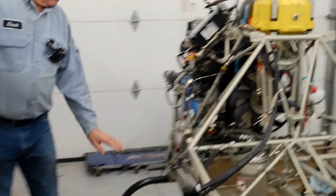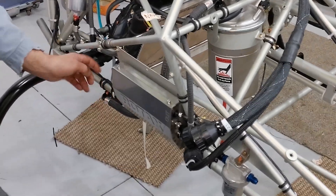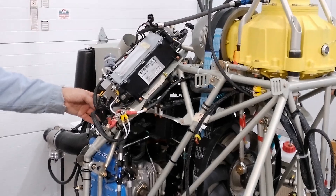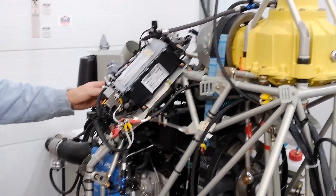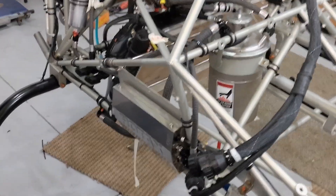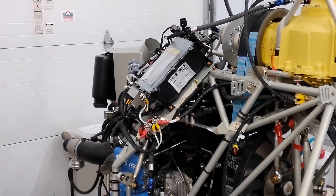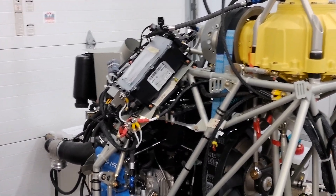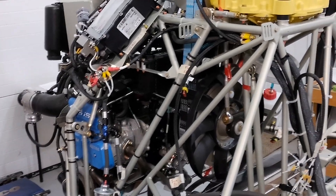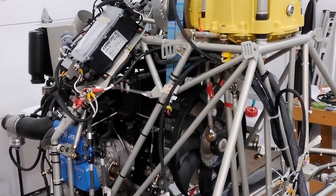I finished up the fuel pump — it's been here, but there were some wiring harnesses I had to make because the harness had just stopped here, and I had to tack in some wires down there and plug them into the pump. That's all done. I labeled the wires, and I know I mentioned pumps A and B. A on this airframe is going to be pump one, and B is pump two, and that got cleared up.